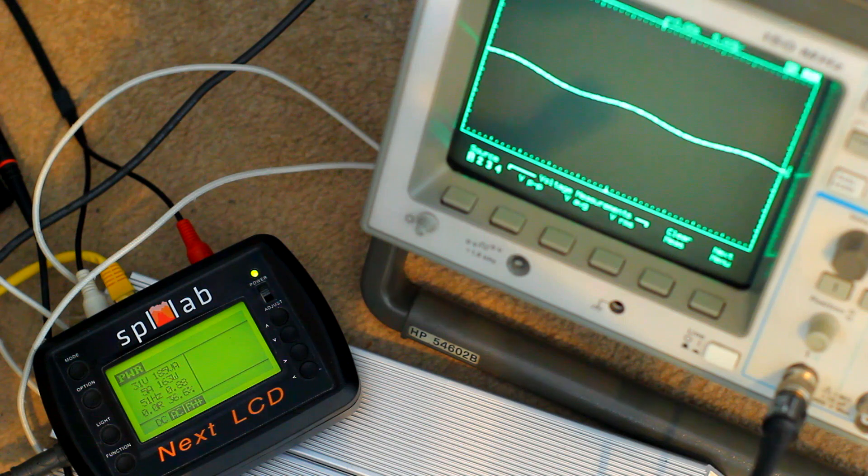The 550 is 65 watts per channel at 8 ohms, and we hit about 120 watts at 8 ohms on the 550. Just before clipping they are proving to do double their rated RMS output. This is quite nice and I respect Technics for this because they've obviously rated their amplifiers at a very low THD percentage on the spec sheet. We're driving it just before clipping, so THD will be a little bit higher than rated, but still perfectly usable up to this point you're seeing on the scope. Very, very good power.